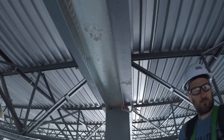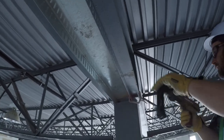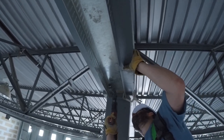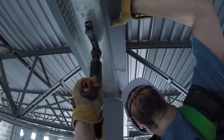Every time I'm at a column I check the height there, and I also check the ends of every 10-foot section of track I put on. If the number is way different, I measure in the middle; if it's similar, I write it down and carry on. A lot of walls can be cut all the same size, and some go down in even increments. Some are sloped — you literally have to measure every single stud. My first attempt I was using the red strip too high and blew the tops off. The DX351 was cranked all the way down.